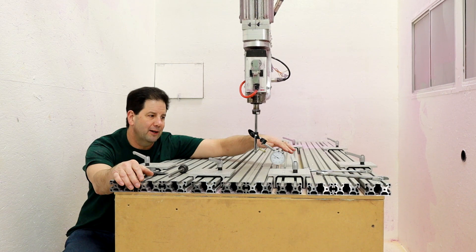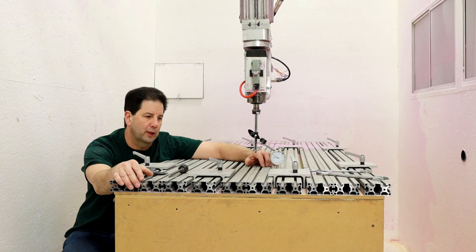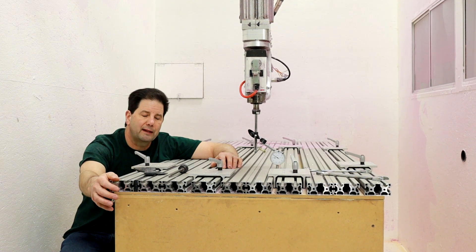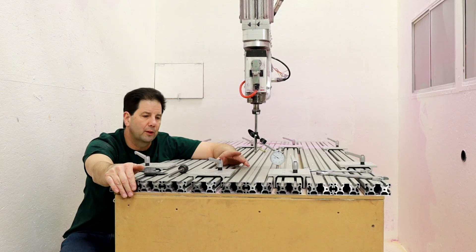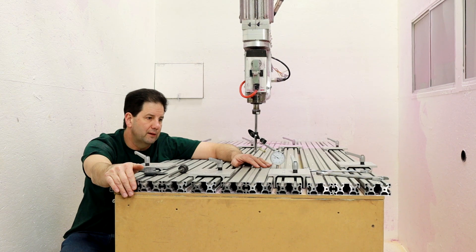The last part is actually checking whether we're level between point A and point B. You'll notice I've got the gauge down low between the actual extruded aluminum. When I trammed the machine in, I did not try to do it with the extruded aluminum on the table — I don't think you can, to be perfectly honest. The extruded aluminum has multiple profiles on it. What I did instead was put an MDF board on the table and mill it flat with the machine itself, so that surface was completely parallel with the whole machine. It's accurate enough for what I needed — this is a router, not a mill — so it's within about half a millimeter to one millimeter of tolerance. It's kind of hard to get all the different touch points just because of the setup; right now you wouldn't be able to recalibrate without pulling all the slats off, so there are certainly some variables.